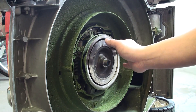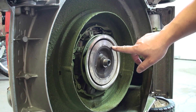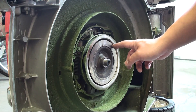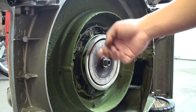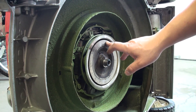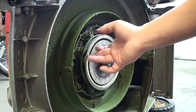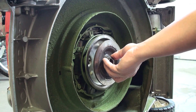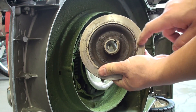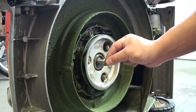Examining the driven part for the clutch — the inner portion being contacted — I can feel it's super smooth, and there's no place in town that will machine them. So I'm going to use some sandpaper and emery cloth to roughen this up and eliminate the glazing, and I'll do the same for the blade brake section. To do this we carefully pull the disc out of the mower — note there's a keyed notch and a small woodruff key that you don't want to lose.